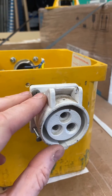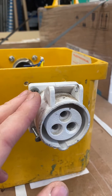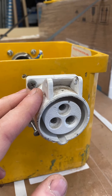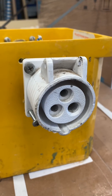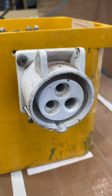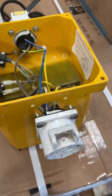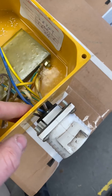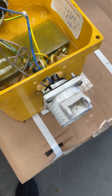The protective cap, which gives it its IP rating, has come off, so that would allow dust or liquid to get inside the socket. Luckily, that socket can easily be repaired just by getting a replacement flange socket, popping the top off the transformer — it just screws out — then we screw in the terminals and you can perform the test.